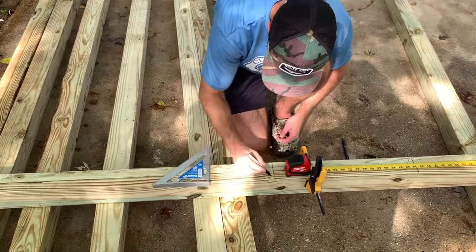After cutting the bottom plate to size, I'm taking it over and placing it on top of the shed base across from the top plate that I cut previously. For efficiency, I also cut the top plate and bottom plate for the second sidewall at this point. That way, I can mark the stud spacing for both sidewalls on the top and bottom plates at the same time. The sidewall stud spacing is based on 16-inch on-center convention.